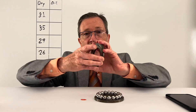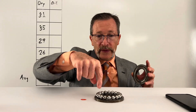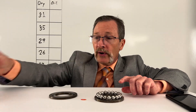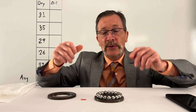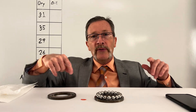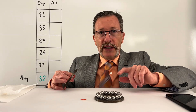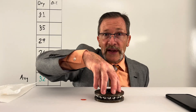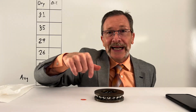That was a mess, and it took a very long time to get all the oil off of these races. I left the three spheres out of this new configuration because once oil gets onto this metal it's nearly impossible to get back off. I ended up using some rubbing alcohol, which cleaned it up pretty well. It's amazing the amount of oil that got everywhere. Now we know: with only three bearings running dry, it spins freely for a long period of time. That oil actually slows it down. So let's try to answer why that is. We already found in previous videos that when I have a full stack of these bearings, they do not want to move. You can see that top race rolls or slides on there without the balls really rolling.